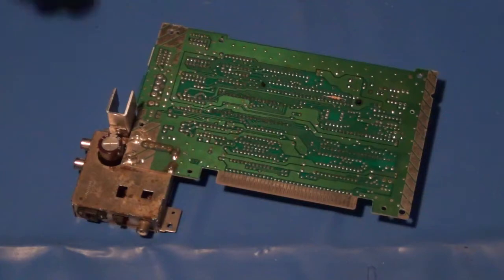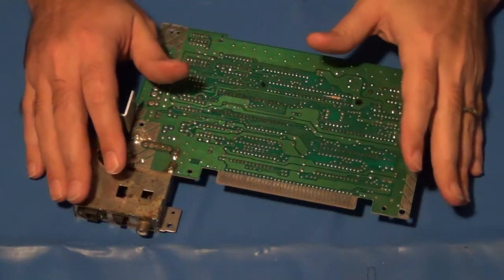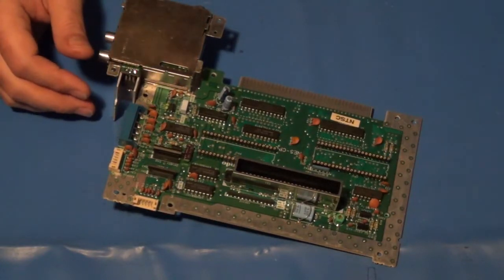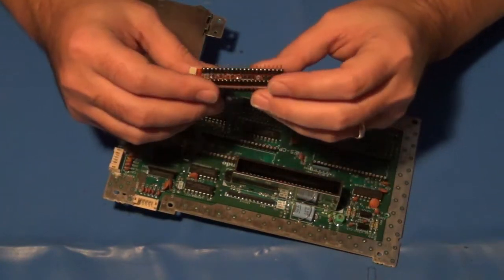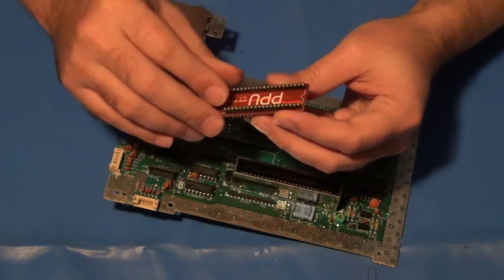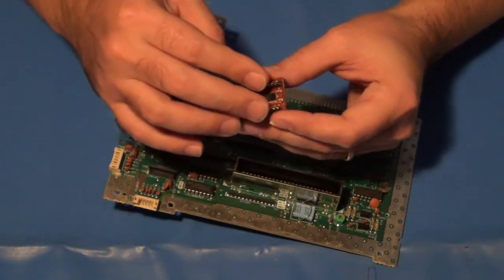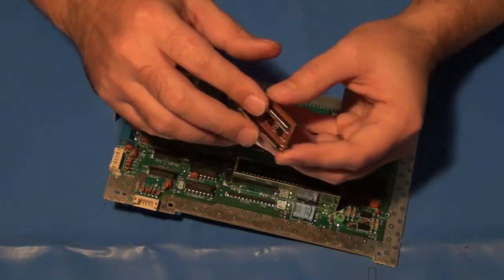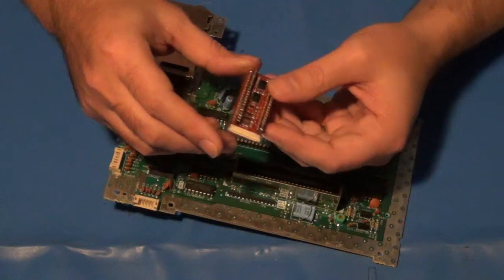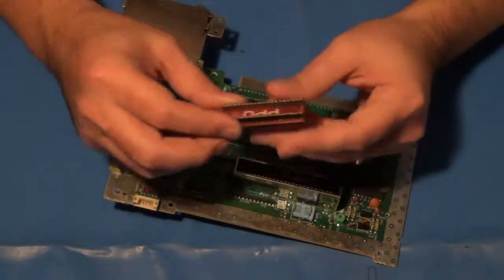Okay, a quick addendum here. And this is my fault, so learn from my mistakes, don't replicate them, and that's why I'm mentioning it in this video. One of the things I didn't do that I should have done, and it's actually two things, is that it's going to be difficult for me to solder on the top row of socket connectors on the interposers that the actual processors will go back on, because now that I have the interconnect headers in place, I really don't have much room to solder those pins. So yep, that's my mistake, my fault, don't replicate that. I'll have to fight with that in a little bit and take care of it. But more importantly is this.